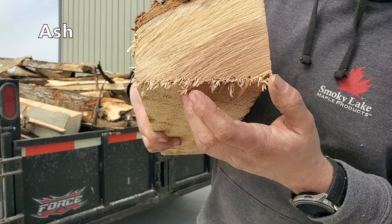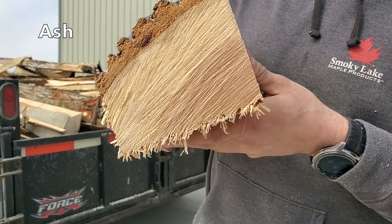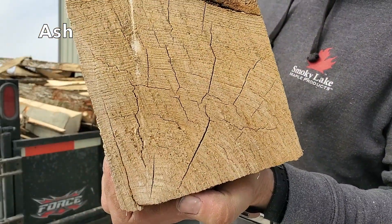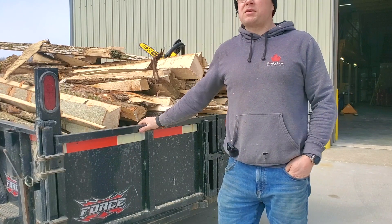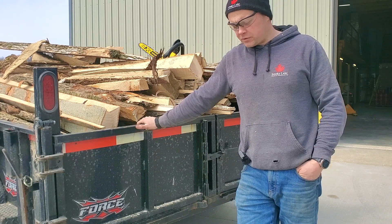In fact, so dry that you can actually see the dry porosity that used to carry moisture in the small part of the rings — absolutely bone dry material. The raw end was checked just like all the other logs. The beech, even though it appeared pretty dry, didn't have that visible porosity at all.